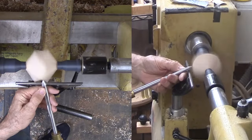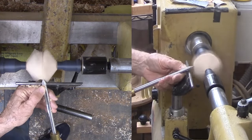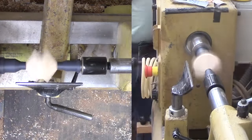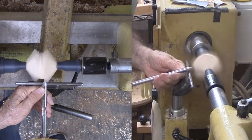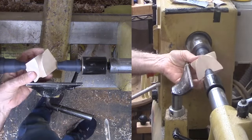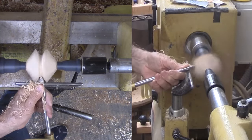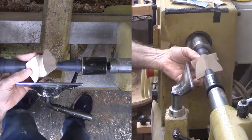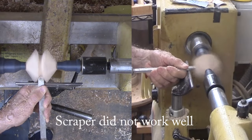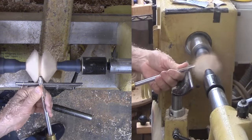This cube of maple is just under two inches each side. It is mounted between two special centers mounted to the spindle and to the threaded live center. The only thing special about these centers is that they receive the corner of the cube. With two corners captured in the centers, there are six more corners now rotating with the lathe — split into two groups of three. Each trio is, in effect, in the same plane on this axis. Their ghost image gives me guidance for my cut. With my spindle gouge, I am aiming to cut a cove between the two sets of ghost images. Easy does it. This is almost entirely interrupted cutting. Only when the cut is almost at full depth is there a continuous cut.